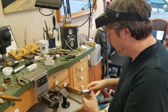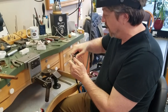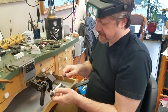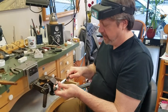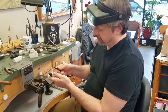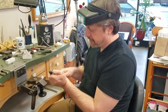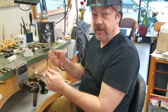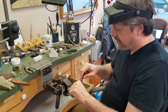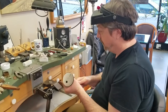First, we're going to talk about changing the hand pieces on your flex shaft. This is the standard hand piece you usually get. A lot of people switch these over to quick releases, which I've done. My wife just got me a new quick release for my birthday. Whenever you're changing, you want to make sure you get your shaft turning just a little bit because there's a slot in the shaft that fits into a groove here, so you always want to just get it spinning a little bit and pop it in while it's turning so it lines up just right. Also, the reason you want to keep one of the original hand pieces is because tools like this wax carving tool fit on it very nicely.